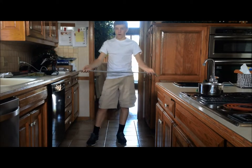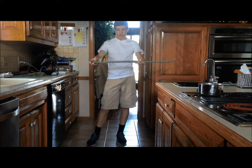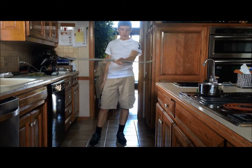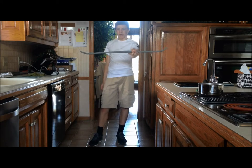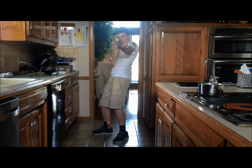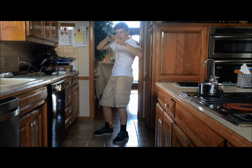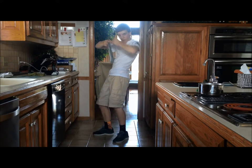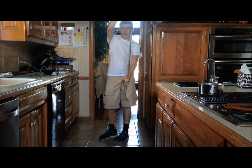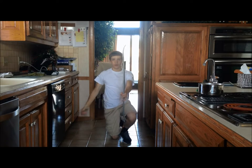Before you move on, we're going to mold the handle to your hand a little bit. But before you move on, you want to make sure that this curve matches this curve, which I did pretty close. I mean, you can't really get it exact. And then you want to make sure that it's straight. You don't want to have any curves or anything. If it curves up like this, that's fine as long as it's against this curve. You want it to curve this way and then go back that way. You don't want it to be straight that way unless you're making a longbow.